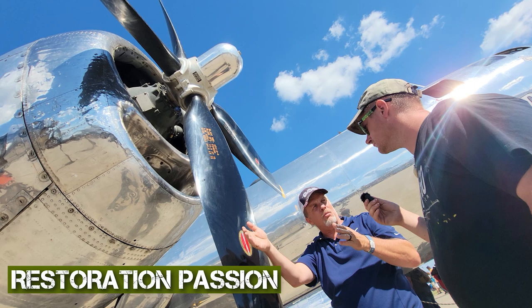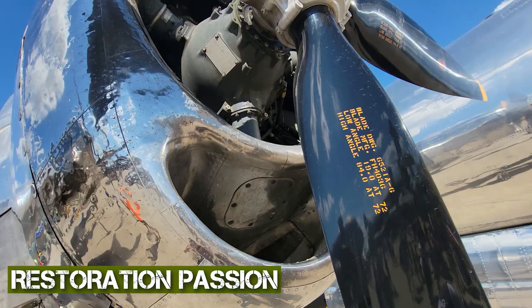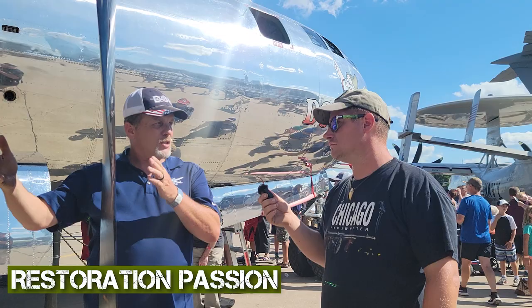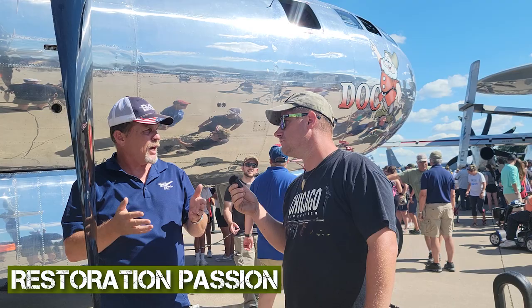All right, sounds simple enough, right? But like we talked about, there's cooling air being rammed into there that would have to run over that exhaust, right, before it got to the cylinder. It's not very effective. So what we did is we figured out that the back end of an engine off a Skyraider, -26WD, actually bolted to the wing box of our airplane, and it had the drives that we needed. And if you combine that with a rotating assembly and the nose case off a -95W, actually we took them off some AC-119s, mm-hmm.